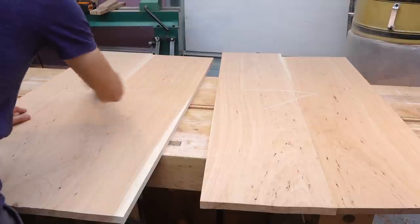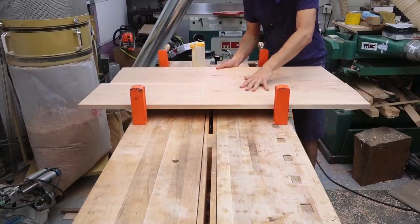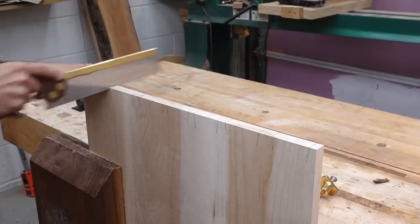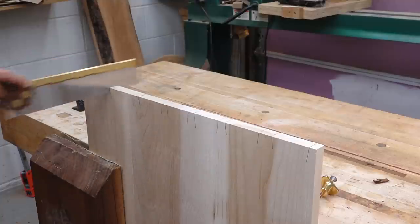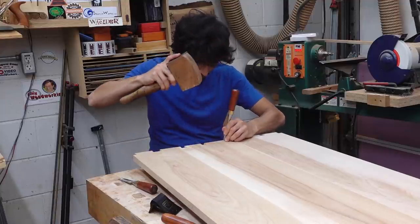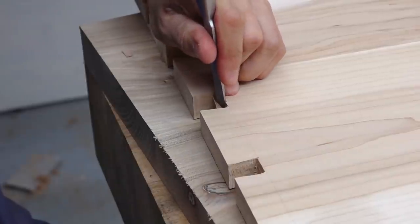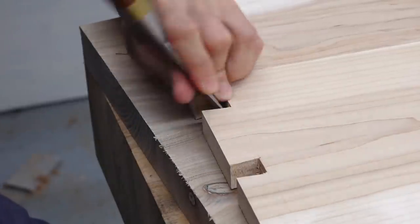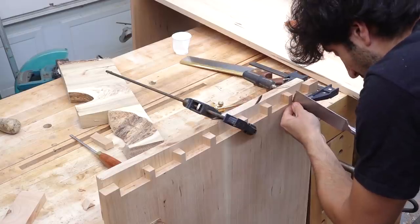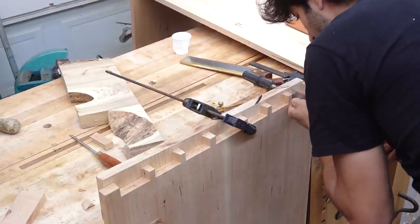Besides that, I got a whole bunch of work done on the HiBoy this week. I finally got started on the upper case. I had the panels for that milled up a few months ago and I got those milled down to final dimensions and got those glued up into the final panels for the case. Those four panels — the top, bottom, and the two sides — get dovetailed together. Those are through dovetails and I'm pretty sure I haven't done through dovetails, especially on a case that large, in years. Someone will probably correct me if I'm wrong, but I'm pretty sure I haven't done that in a long time.